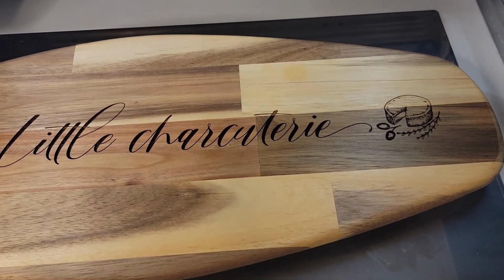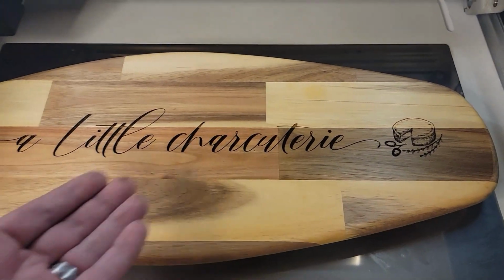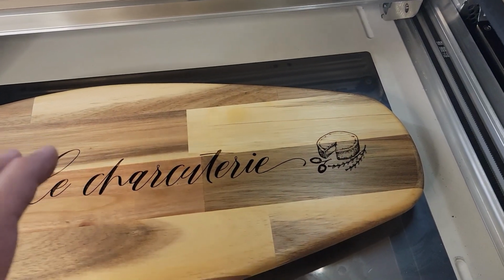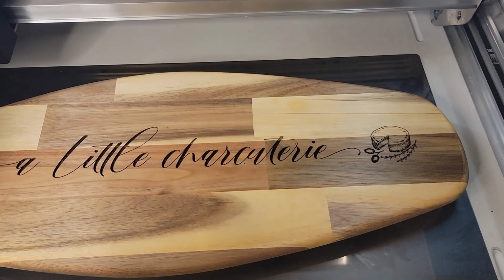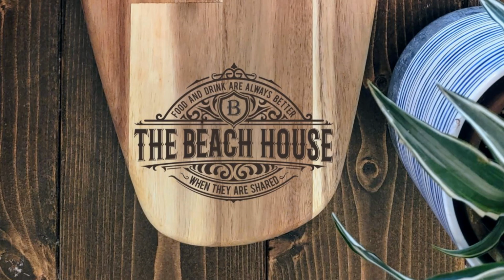So for settings on something like a cutting board or a charcuterie platter that's elevated in the bed of the Glowforge, I like to use about a 725 speed and about a 60 power, and just leave it at the default lines per inch. For the designs that I do, they usually take around 15 to 20 minutes per design.